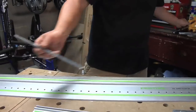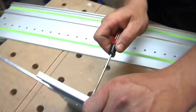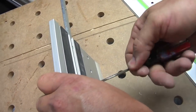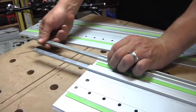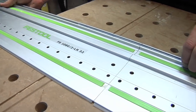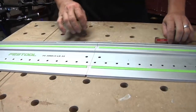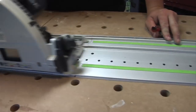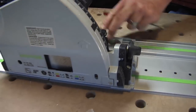First thing I do is I take the one, slide it in here, and just quickly tighten these down ever so slightly so it doesn't slide everywhere. We're going to slide the top one in and we can leave it loose because we can always handle it. I'm going to slide the other rail together. I'm making sure that the screws are kind of equally spaced and I just grab my track saw and lay it on here, and I want it to help bridge it and make sure everything is kind of straight in line.